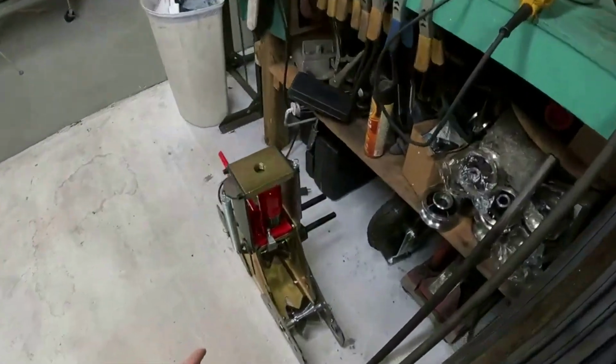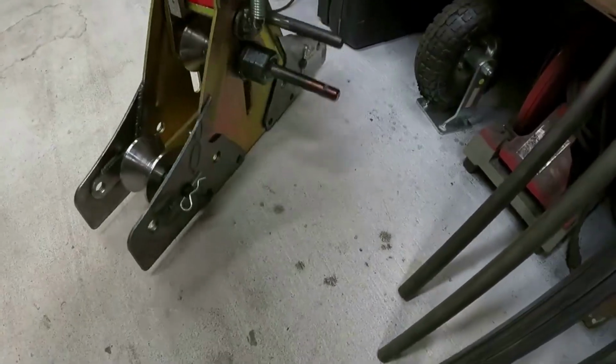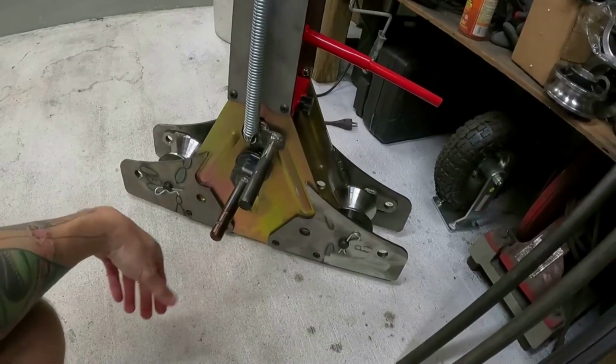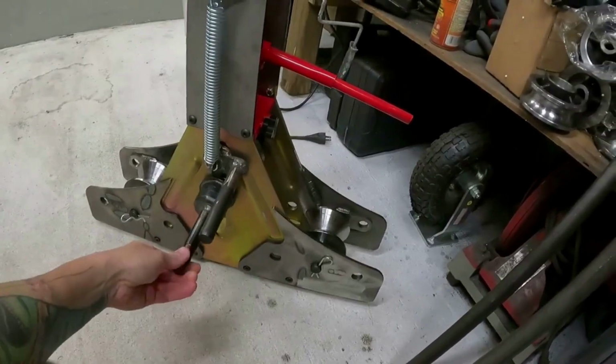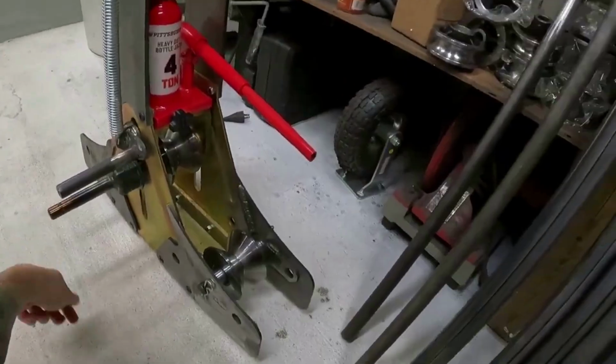We are going to start doing some square tube frames. So I got the bender done, ready. Everything's been finished, welded on. It is ready to go. Added the wing kit. These are the V dies you need. Those are the dies that you need to bend the square tube so that it looks like a diamond shape.